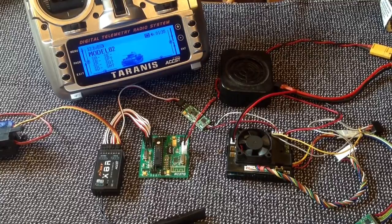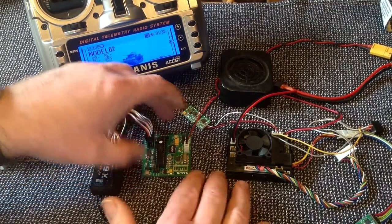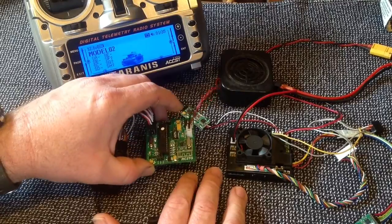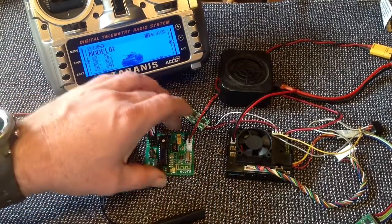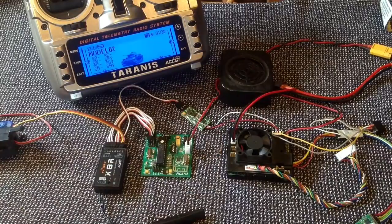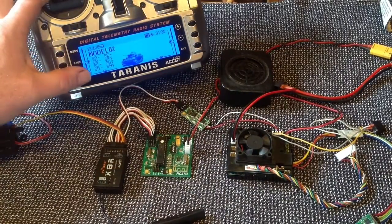In this video I would like to introduce a board that Andrew has been working on for probably the entire year. I forgot when he started working on it, but it's been quite a while. A new RC2TG board, which stands for RC2Taigen board. Basically, this is very similar to our popular RC5HL in that it will allow you to control your Taigen 2.4 MFU using a true, proper, hobby-style radio.